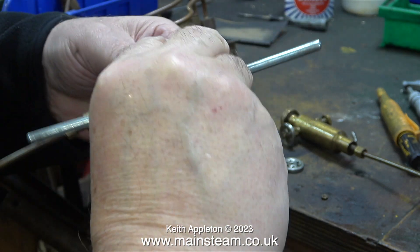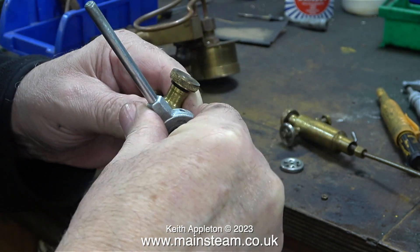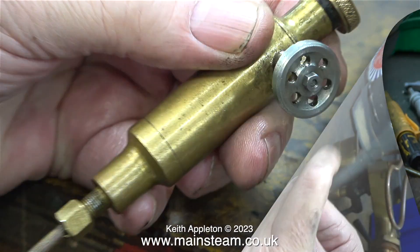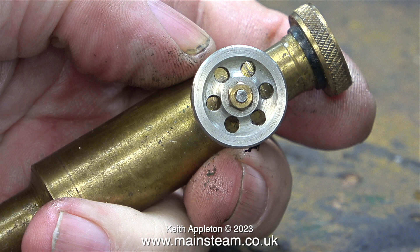One of the hand wheels — or should I say the shaft that the hand wheel is mounted on — needs some attention. The hole in the hand wheel is squared, and so is the shaft. The only problem is this one needs re-threading 7BA. Originally it was fitted with a 6BA nut that was massively too big. The clip shows the hand wheel now held in place using a 7BA nut, and to finish the job I ground off some of the nut to make it look like the one at the other side. I will give these lubricators a good clean and fit them back onto the engine after I've fitted the boiler.